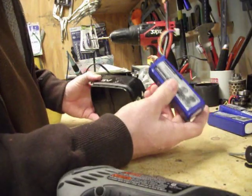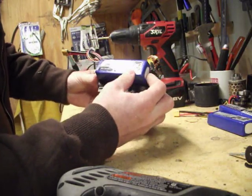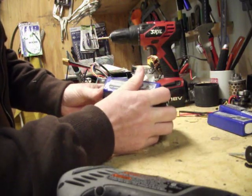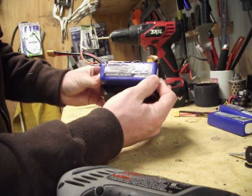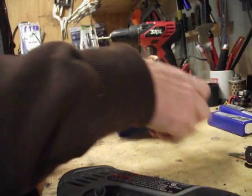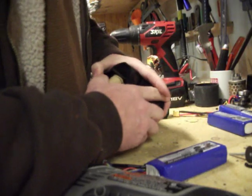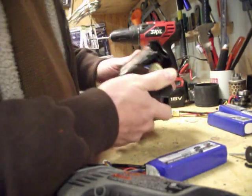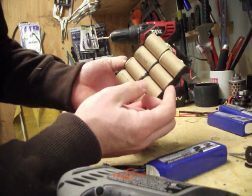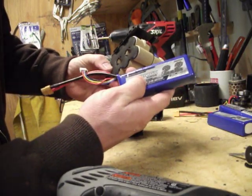Here are the batteries I'm going to be using. When I was looking for batteries, I had to make sure they were going to fit inside this pack. I pulled these apart before I ordered the batteries to make sure they'd fit — and they'll barely fit. I just have to dremel out some stuff on the inside. So there's the old pack: 18 volts, 1200 mAh. I'm going to swap in 22 volts, 2200 mAh.